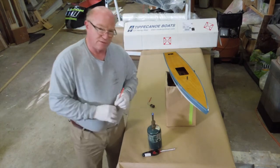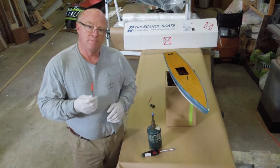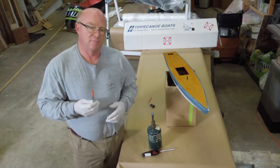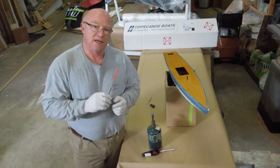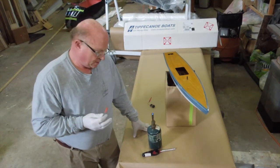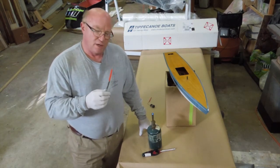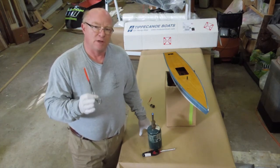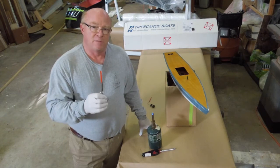And what we're going to do is flame treat this. Now, if any of you do snow skiing, you've had P-Tex bottoms on your skis. P-Tex is polyethylene. And as I said, polyethylene is very difficult to bond to. But this is how we get structural bonds. Now, this is called flame treatment. The flame is going to blast the molecules apart at the surface. We are not melting. I want to say again, we are not melting this. If you melt it, you've gone backwards.